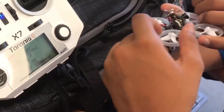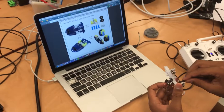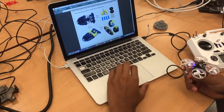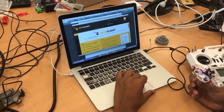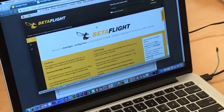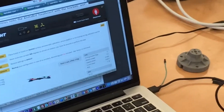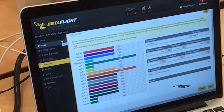In order to set up all your switches, you're going to go into Betaflight, which we need a laptop for. You don't want to plug your battery in at the same time that you plug your USB in, unless you're on the motor testing tab. So we go into Betaflight, and it opens up — you go to dev/tty USB modem 1421, or you can click auto connect and it'll connect automatically. It shows up and it's doing its thing. We go into the receiver tab.